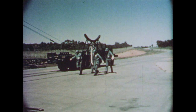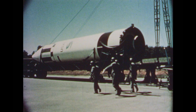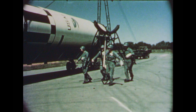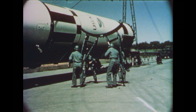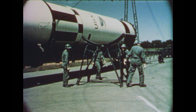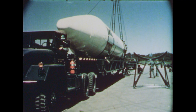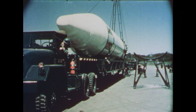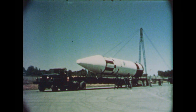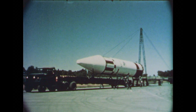The missile support stand has been completely assembled and left near the erector truck. Now it's carried from the truck, along the H-frame, past the launcher, along the side of the missile transporter, and then placed near the front of the missile at a point near the forward erecting bolts. The stand supports the missile during horizontal checkout, warhead assembly, horizontal maintenance, or troubleshooting. Through the wire rope system, the A-frame is again pulled back and the forward end of the missile begins to raise. The missile transporter has served its purpose and may be driven from under the missile.